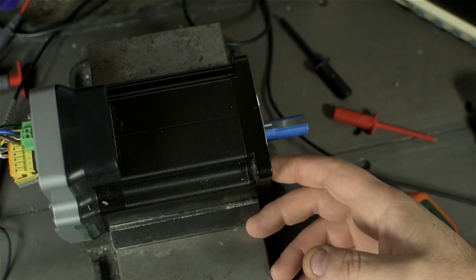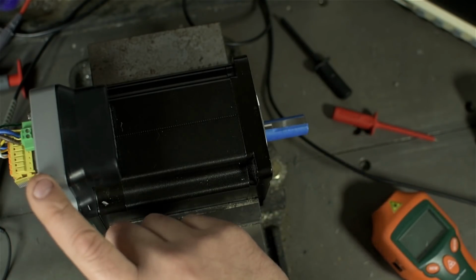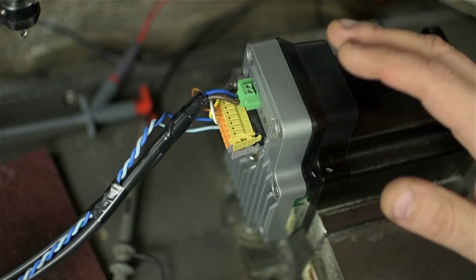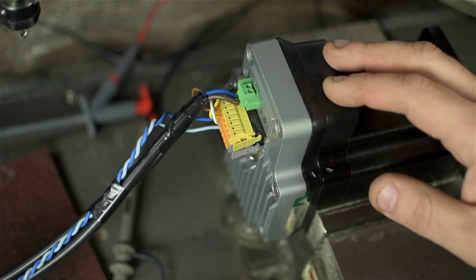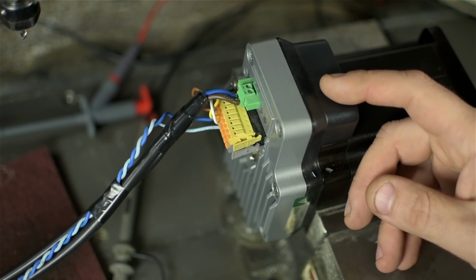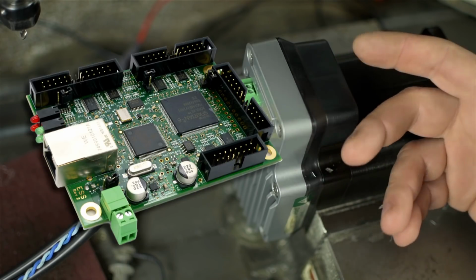How could a wrong setting result in a different speed in two directions? I mean, after all, the direction signal is just either high or low, and the step pulse train should be exactly the same. At first, I figured it was a wiring problem, but that checked out. Then I started to suspect the other end of this, my breakout board, which also ended up checking out just fine. I got to worrying that it could have been the smooth stepper, but have you ever seen one of those? I wouldn't even know where to start.